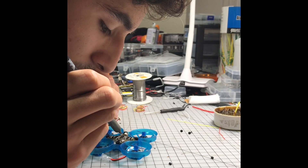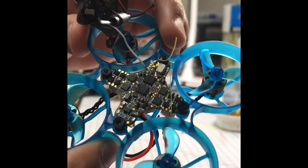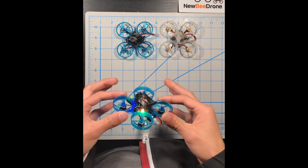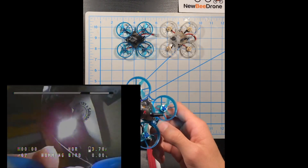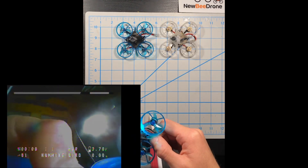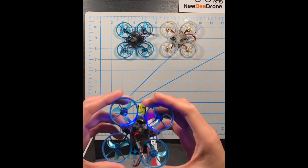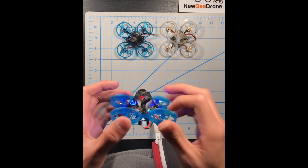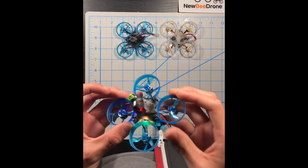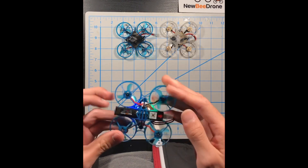Now we're back at the house, and after adding that wire we finally have OSD. At this point you want to go ahead and flash either the no-OSD or OSD firmware — there's a video linked in the description by Chris that shows how to do that, including the 48 kHz ESC flash. Check that link for a crystal-clear tutorial on the firmware update and ESC update, and after that we are ready to fly.